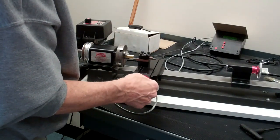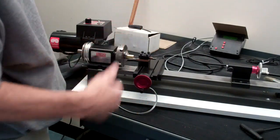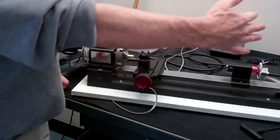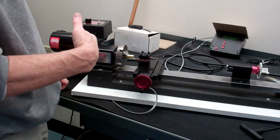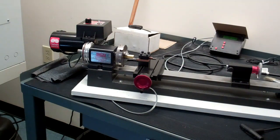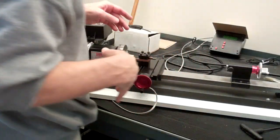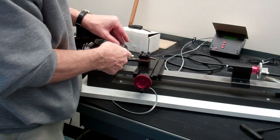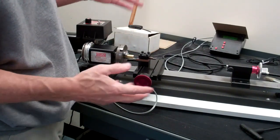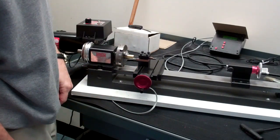What I'm going to do is take a light cut along the end. The way we're going to control depth of cut is with our Z axis. I'm going to bring this down to about a five-thousandths depth of cut. Since we're turning, we're only going to bring the tool into the center of the part, and by the time you get to the center of the part — because the part is turning — you'll have faced off the whole end.